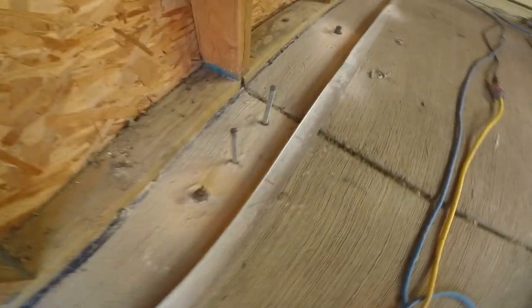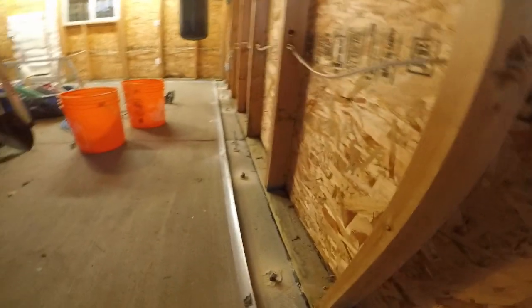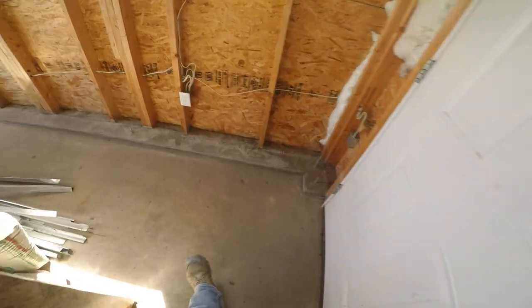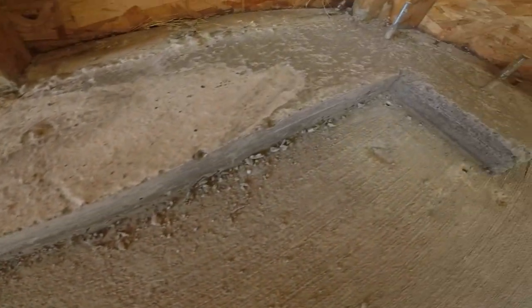You can see we just drilled in the rod so we can fasten our bottom track to it — it's set in the concrete. We pre-laid out where the track is going to go and put the rod there. We'll drill the holes in the track and then bolt them on. It's going to be beautiful. We used 15mm rebar, drilled in every two feet, with the rod going in two inches at the ends and in the centers.